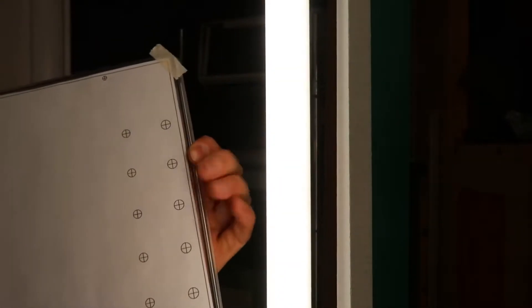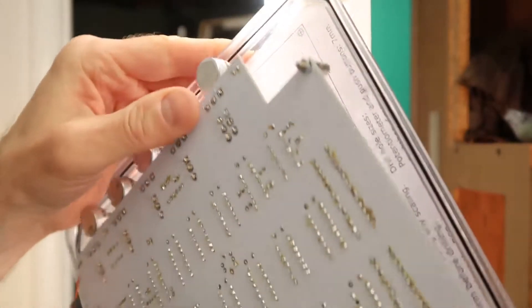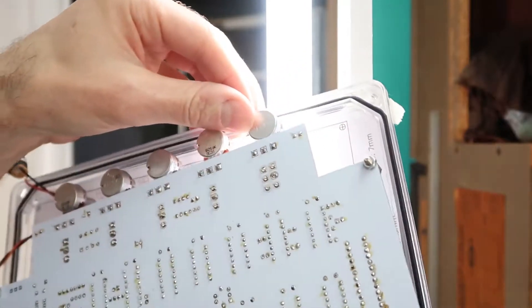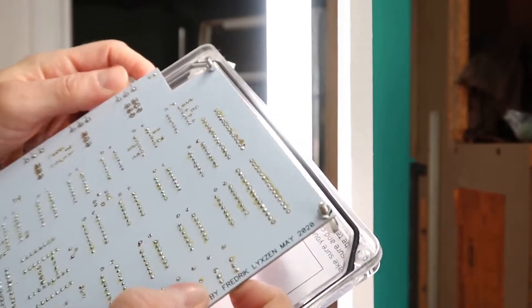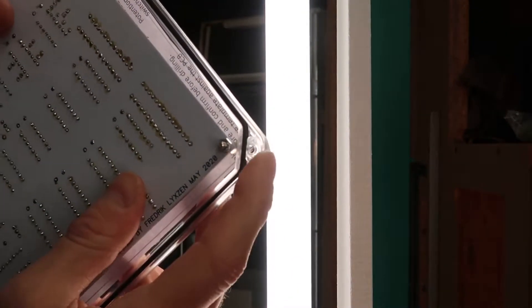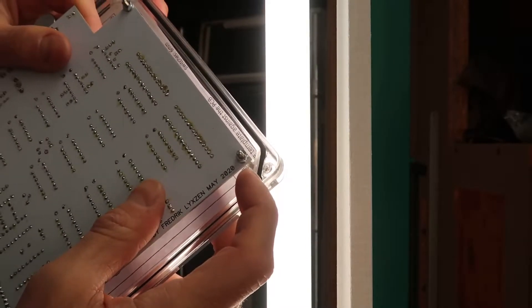It did take me a while to get this template on straight, and it's actually not quite adjusted right yet. If you have a nice backlight you can shine a light through it. Make sure you have enough space for your potentiometers to fit inside the lip of this lid, because they're very, very tight. This one still has about a tenth of an inch before it hits. Also check the corners - you've got studs on the circuit here, and this stud won't fit inside that corner. It's too close, so I've got to move this whole template just a little bit north to make it fit.